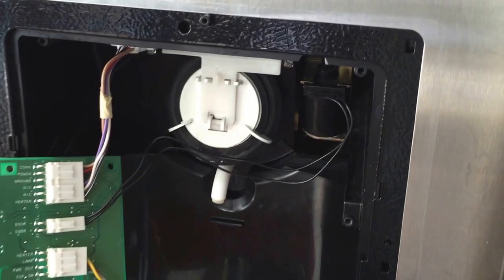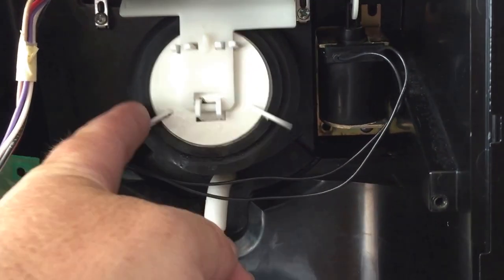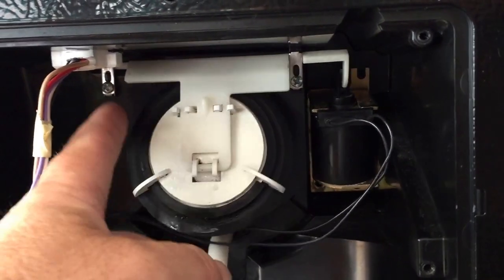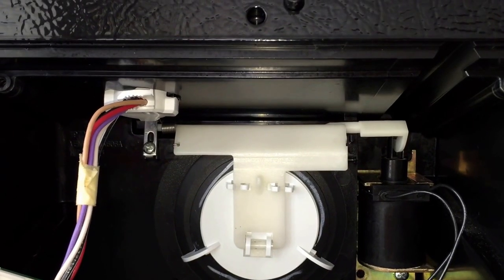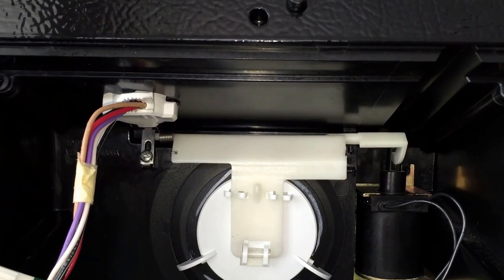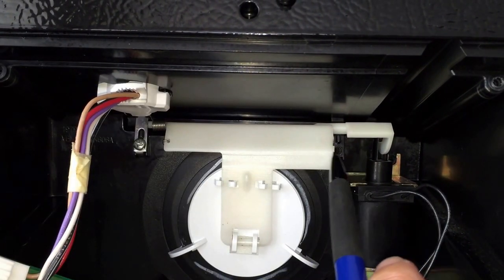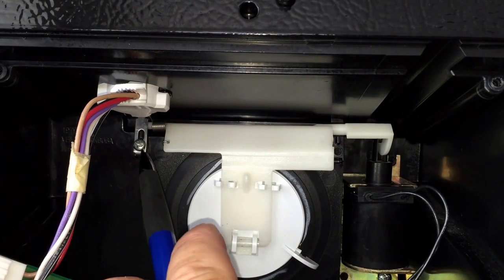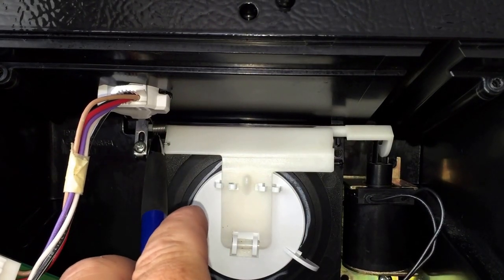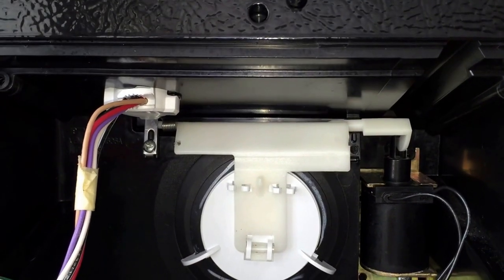While we're adding the heating element, we're also replacing the flapper here, which can get weak. If that hangs open it lets cold air right down on the dispenser, so we're going to replace the flapper and the flapper spring. A key thing when taking the flapper door off: there's a captured spring that will fly out and get lost. There are two screws — one on the left and a similar one on the right. You can loosen one and remove the other, then pull the door off up and to the right, but watch for that little spring — it will fly off.